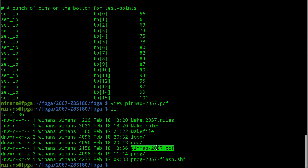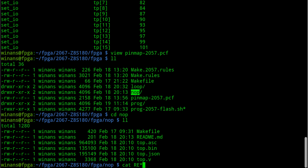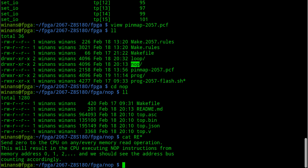So the first thing I want to do is my no-op test. For all I know, I have no idea what I'm doing until I see the thing do something. The simplest thing I can think of is connecting the data bus to all binary zeros and just let her fly - as if the CPU reads memory, it gets all zeros. On a Z80, a zero is a no-op. So in the readme file for this particular FPGA application, I've got a note: send zero to the CPU every time it wants to read anything. If it's fetching an instruction and gets a zero, it'll do a no-op.